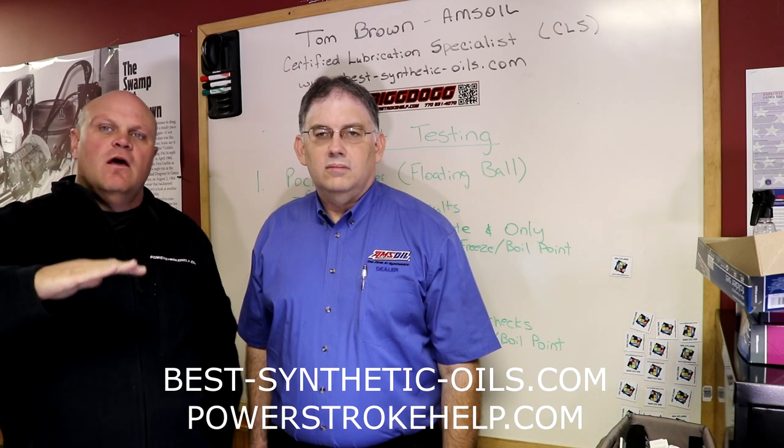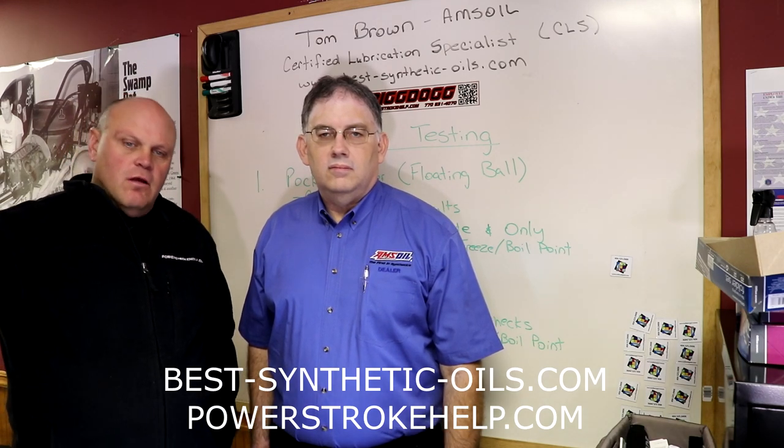Because of the fleet applications we were working on, we made the decision to just change the coolant at 50,000, use only Ford coolant. We would drain it, fill it up with water, close the petcock, fill it up with water, drain it again, and then fill it with coolant and send them on down the road. We've had no troubles out of any of the fleet in terms of any breakdown of the solders or the metals or anything inside of the coolant systems.